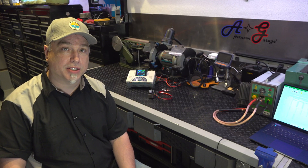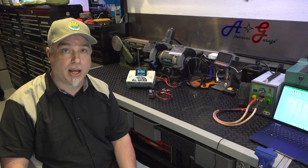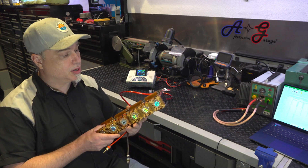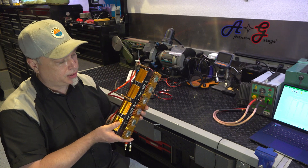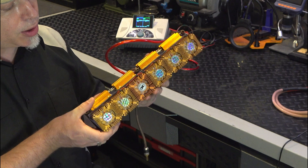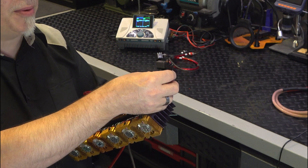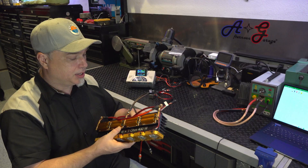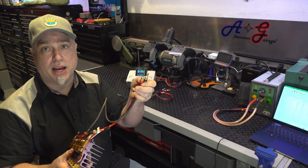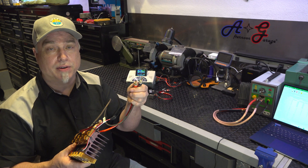Also last week, we talked about some kind of a load — sufficient enough to load down these battery packs, discharge them, and dissipate all the heat. So this is what I came up with. I epoxied these resistors on here and added a whole bunch of fans, hooked them all up in parallel on a 12V supply, so they run all the time. They have the same kind of banana plugs as my test cables. This will be handy when discharging my first battery for the first time.